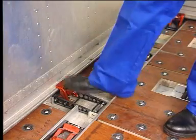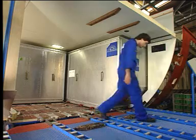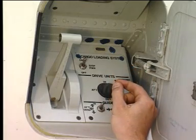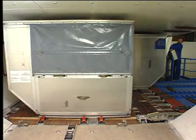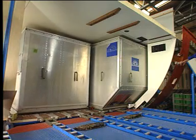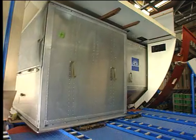Unlock the second container by lowering the container latches. Select out with the joystick. The container starts its lateral movement. Don't forget to move the sill lock handle down to lower the overridable door sill latches. The container leaves the cargo compartment.